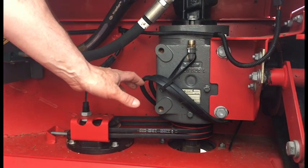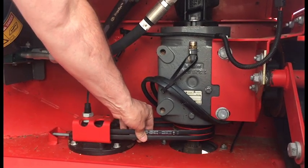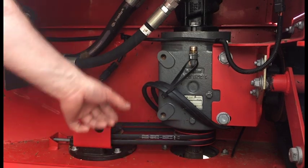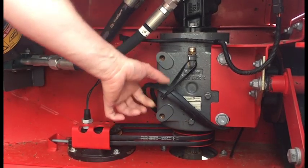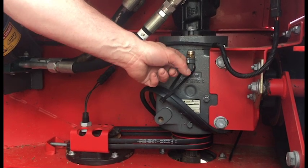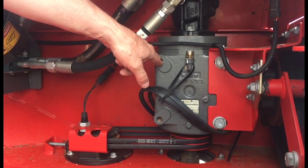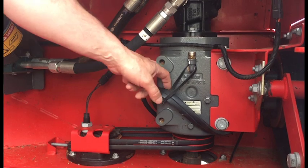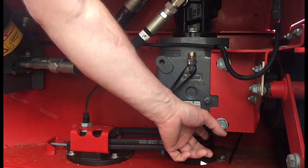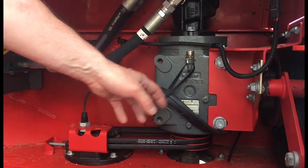This is a really good example of what we found to be a time saver for you. When you're doing your maintenance and you put a new set of belts on and you have the u-joint and the cage all apart at the front, what we recommend is take another set of belts — you can see the zip tie on the side here — it's just around the breather on the gearbox. Some fellows will put a bolt here so it doesn't bust the breather off, but you basically want to put another set of belts in there, and two zip ties will usually hold it into place.